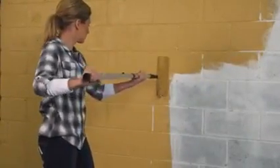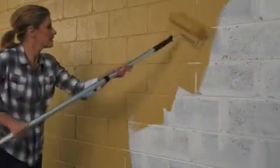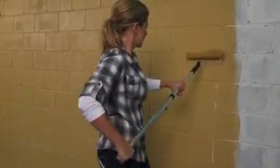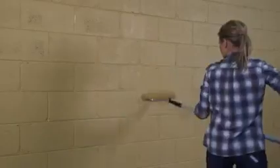While the paint is still wet, broadly spread it diagonally with your roller. Then, add a new strip of wet paint to create a working wet edge. Now lightly roll the previous section with a downward motion to create an even finish. Remember to lay off the entire wall in the same direction.